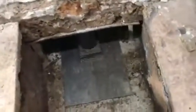We have 3 that we've already done on this back wall. Got everything raised roughly right around an inch and a half. You can tell with those, those are all half-inch thick steel shims that we have between the underside of the pier and that load-bearing steel plate. That's how much of a gap we had to get those shims fitted into after raising our piers.